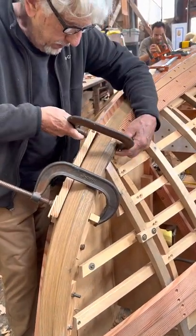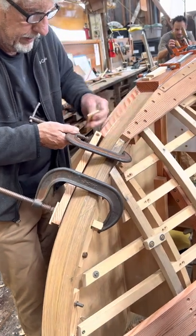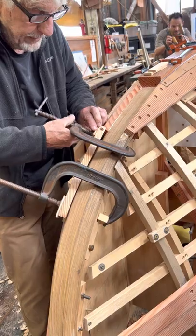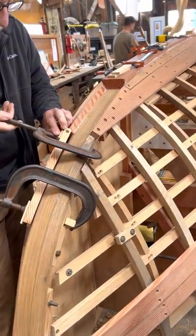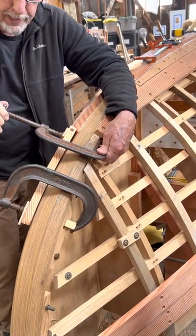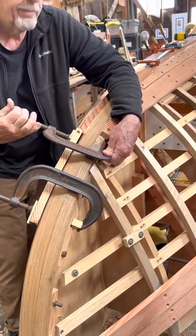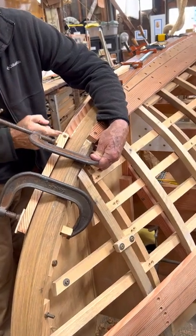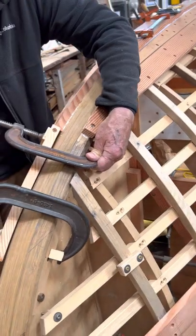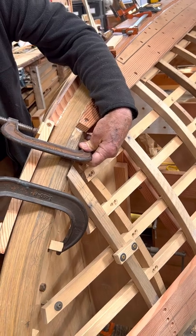I want this to come in here — this landing here is totally fine. I'm going to put a nice soft cedar pad here. The kind of pad is important; the pad should be softer or the same hardness as the wood. This is the dangerous part because you're bringing this in — you saw the curve on the other one. So you trap it here first. Now I'm going to be building the curve in out here. I leave a gap on purpose; this is not intended as a final fit, just the initial fit, which is about capturing this shape.